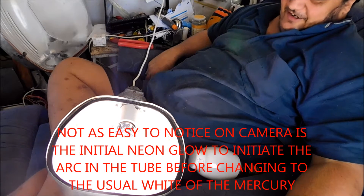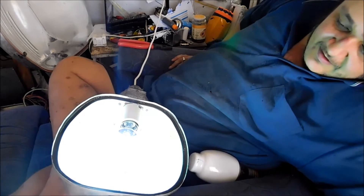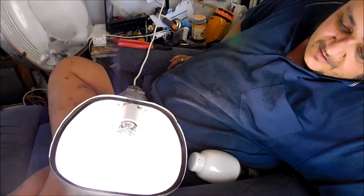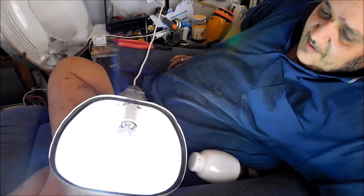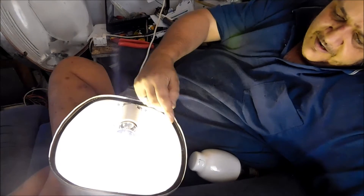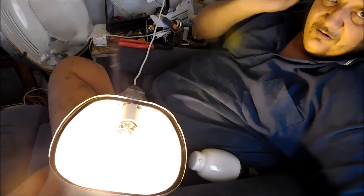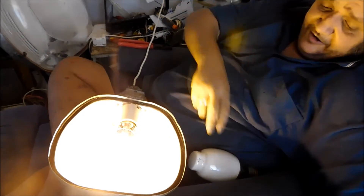Now that's how you start an old sodium lamp — that's a bit different. There's a little switch in there that should open as the lamp warms up. The wire around the middle of it is actually to get the thing started up, like an exciter — like the starting electrode in a mercury lamp.